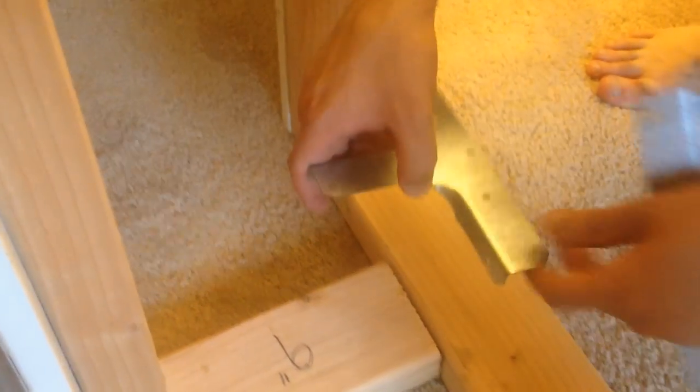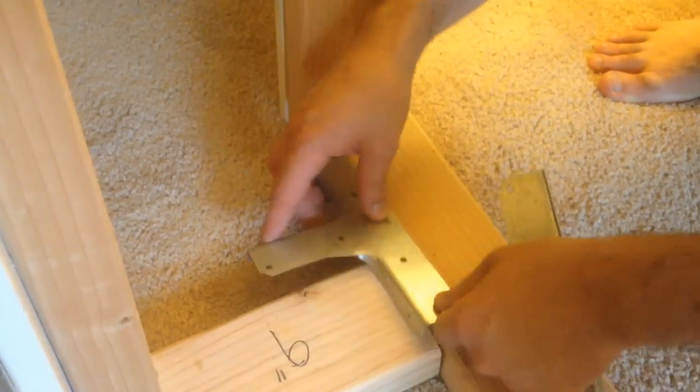We raised and aligned the two segments at 90 degrees and used T-shaped ties to hold it together. We accidentally bought the wrong ones, so we had to make a small divot in the wood to make it fit. As we worked, we put soft foam weather stripping on all the ends that would touch the original apartment. This way we could protect the walls from scratches. Finally, we had the frame complete. It looked pretty much exactly like the 3D model.